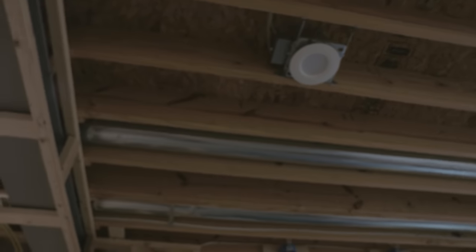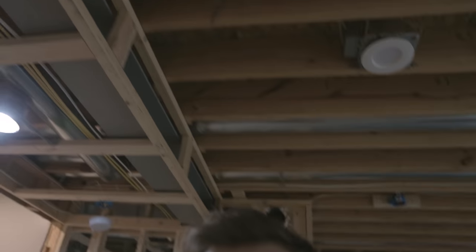That's just about everything for today so far. We found this blue line here which used to be a phone line, but it's Ethernet and it goes up to the kitchen. I'm going to replace that line, tie to it and pull through, and run two network jacks to that. Because on the other side of that wall is the master bedroom, we can open up that box upstairs, punch through the wall, and have one line in the kitchen or at the dining room table and one line in the master bedroom.